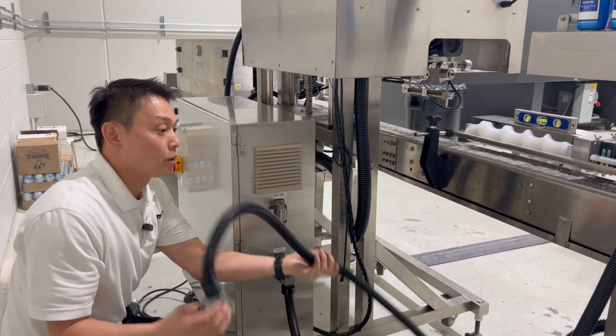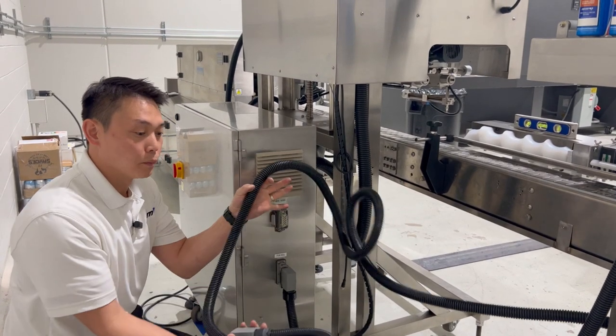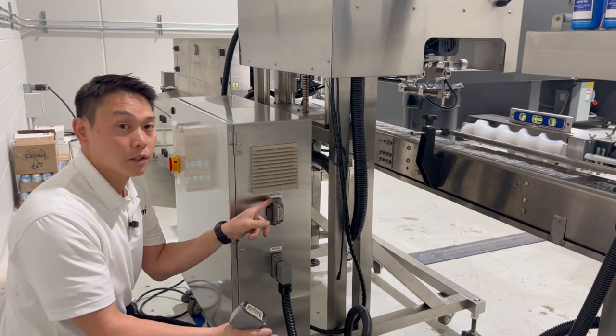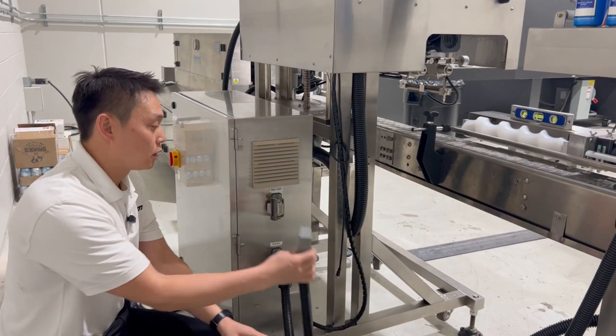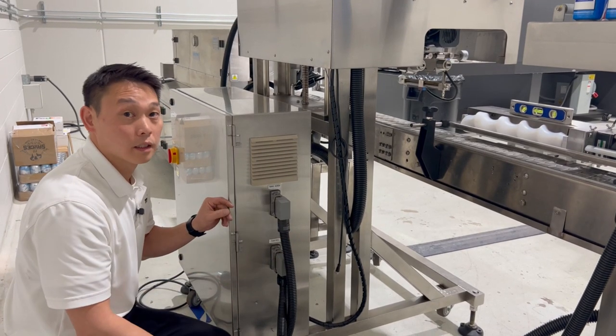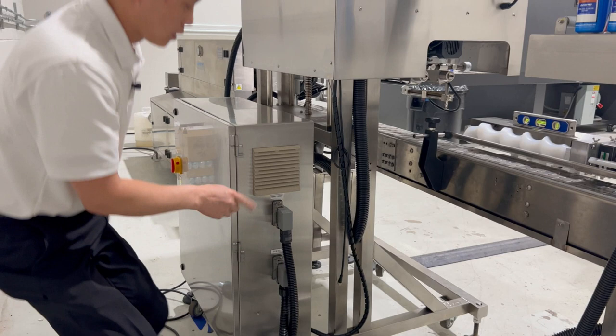The timing screw assembly, again, will have an umbilical cord with a connector that will go into the timing screw device. It's important not to mix these two up. So again, we'll put it in the side and we'll lock it and snap it closed. Next, we'll come on the other side